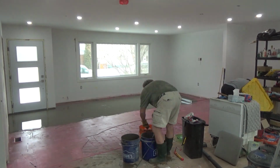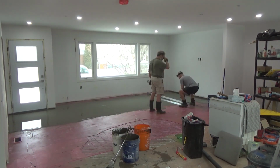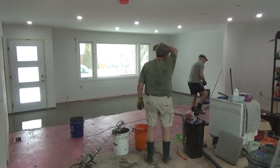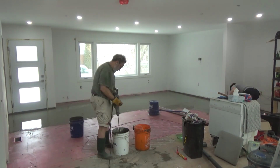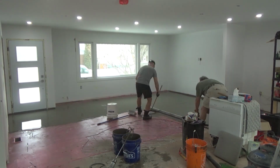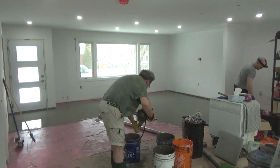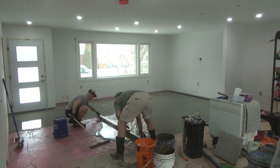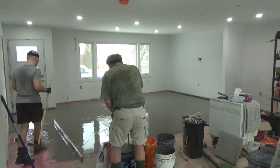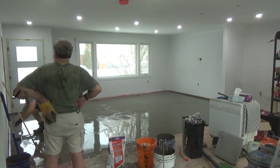But here we go. This is the actual installation, I guess you can call it an installation. This is the pour, except there's lots of little pours, lots of buckets full, and there we go, screeding along with the aluminum straight edge. The instructions call for rolling around with the little pokey rake, so I did that. I also had a little foam spreading tool here to just help move stuff around in little sections and where it was awkward to get to at the end of a run.